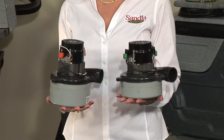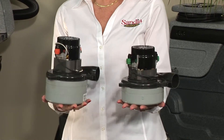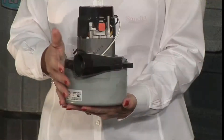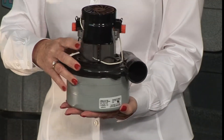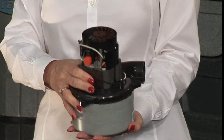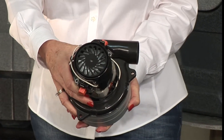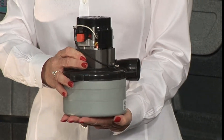The two-stage vacuum motor is very similar to the three-stage vacuum motor, other than a slightly larger motor winding and the addition of a third set of fans, increasing the airflow and lift of the motor. Three-stage motors are particularly effective when used in high altitudes due to the lack of air density.